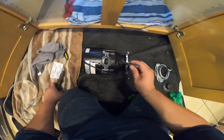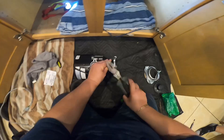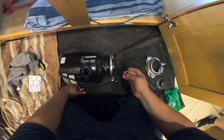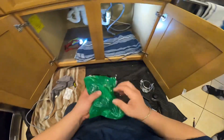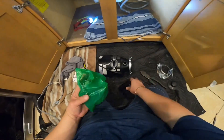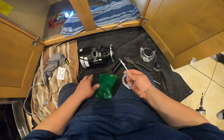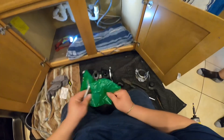Now this is very important: if you have a dishwasher draining into your garbage disposal, you need to use a stick — a metal stick — to pop the cover out. Just tap it in, then put your hand inside the garbage disposal and remove the plastic piece. That's very important — you have to pop it out, because if you connect the dishwasher drain hose through that pipe without removing it, it's not going to drain.